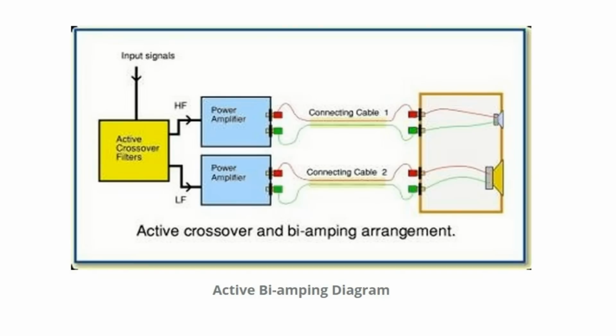Then you've got active biamping. And active biamping is, and this is pretty hardcore stuff, it's when you take the crossovers out of the speaker. Oh, wow. Folks, don't try this at home. Typically, you're going to buy a speaker that has active networks. You know, there are some brands that offer that. And the reason why they do the active is you do all the filtering at the line level before it gets amplified. Understood. So now you really are separating the frequencies. Exactly. So one amp is producing a certain bandwidth, another amp is producing another bandwidth.